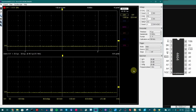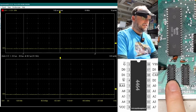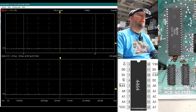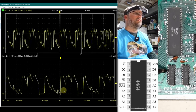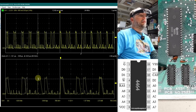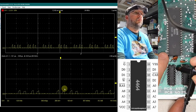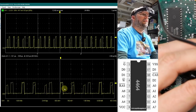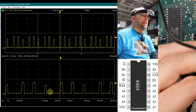Here's the pinout for the RAM chips. I'm on pin 2, which is the first of the four data bits on each chip. Each chip has 64 kilobytes but only four bits, so you need two chips to get a total of 64K across eight bits. We're getting activity on pin 2 and it looks okay, but pin 3 looks really bad — pausing it, something is trying to hold the data bus high, or it's falling very slowly. Pin 17 is data bus three and there's pretty much nothing happening there. Pin 15 shows peak-to-peak of only 2.4 volts — that's completely wrong.